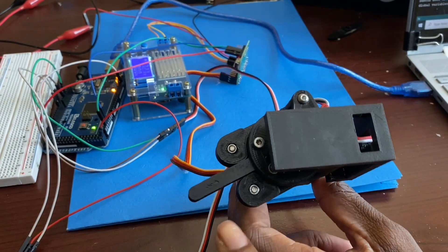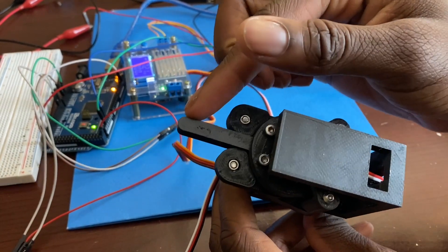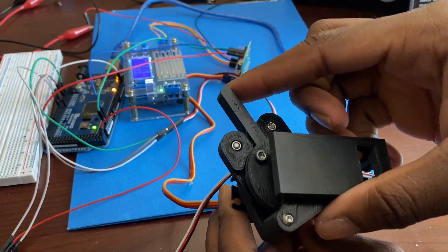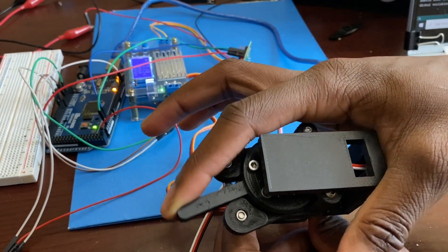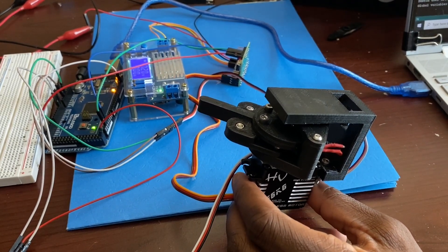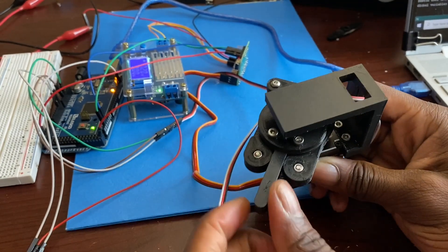You can see that every time I push it just a little bit it measures that spring deflection. If I push it harder it'll move faster — a more drastic movement. It depends on how much force I'm applying, which is measured by the magnets and the hall effect sensor in the spring. I can also change a value in the program so it has a more drastic movement when pushed — if I increase that value and upload it, you'll see it's a lot more reactive.